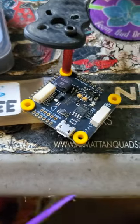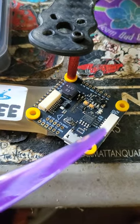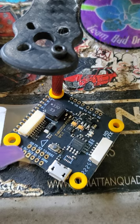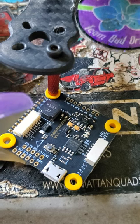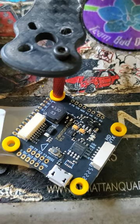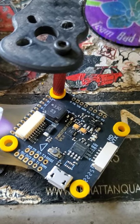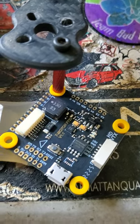If you got the kit from Worry Free it's got a little silicone plug and you can plug that right in the USB as well. Also plug in your connectors that came with the flight controller so that you don't get any trash up inside of there. The second thing I'm going to do is paint everything but the ports I plan to use. I'll be using this area for my receiver, my buzzer is going to go right over here, and my connection for MSP, receiver, or VTX is going to come over here as well. So I'm not going to use any of these ports or plugs - I'm going to use three of these and none of those. I want to keep this bind button protected as well, so I'll paint right around the edge of it.